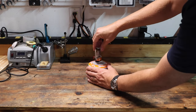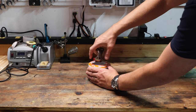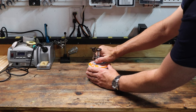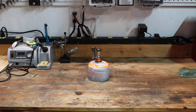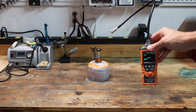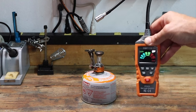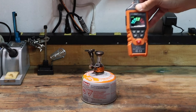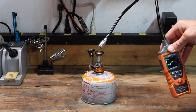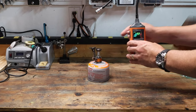We're going to screw it onto the cylinder. What's also nice is this is a different kind of gas than butane — something totally different, so it's a different test than the lighter. We've got this thing all the way on there, nice and tight. The gasket is cranked down and my valve is off. We're going to start at a distance and work our way in. You can see right there, it just shot through the roof. So we know now that this thing does have a leak — I need to replace or rebuild it.